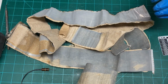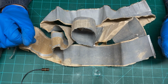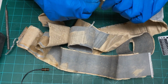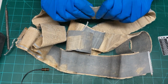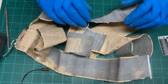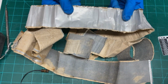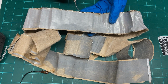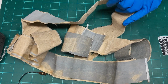Anyway, that's what a capacitor looks like inside. So now you know what to look for when you're testing capacitors, because over the years that electrolyte dries out and these plates will begin conducting through the insulation there, through the electrolyte, and start what they call electrically leaking. Not physically, but electrically leaking. They will also physically leak too. You can see right here where the electrolyte begins to leak out the bottom of the cap.